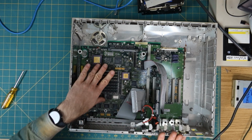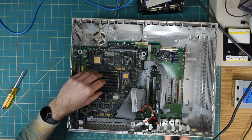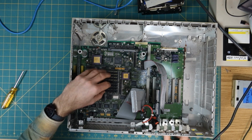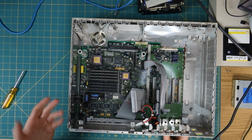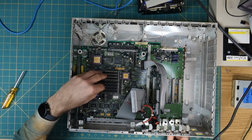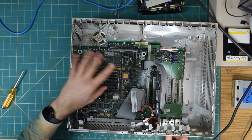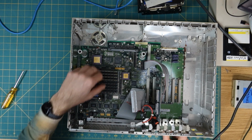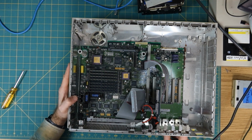And somewhere in this other stuff that I got with this computer, there were a couple other packets of these that I think were 1 megabyte SIMMs. So I have RAM coming out of my ear for this thing. These do use unusual SIMMs because they have a weird access mode that I will talk about later, when I actually get this working, assuming I get it working.